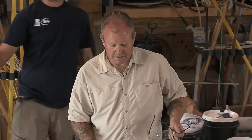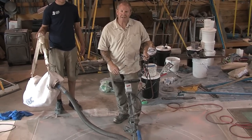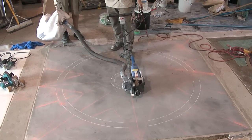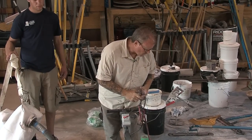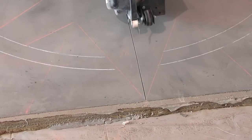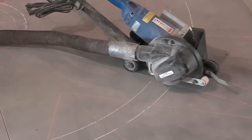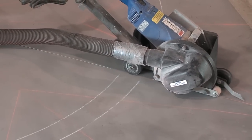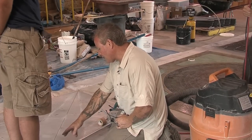Our first saw is our little walk-behind dust-controlled piece of equipment. You can see it's real versatile. These are actually some pretty precise cuts, but with some practice you can use this tool for these cuts. Obviously, a word of caution — any time you're using a high-RPM tool, you want to protect your eyes with the proper safety equipment, like safety glasses as a minimum.